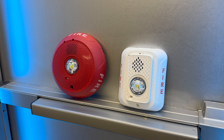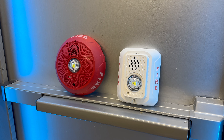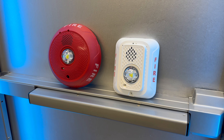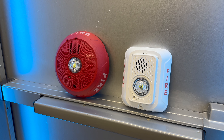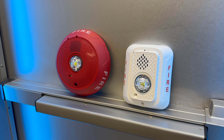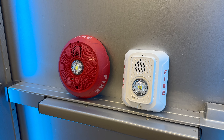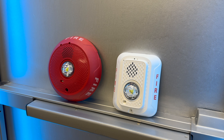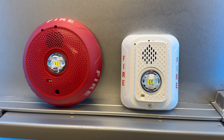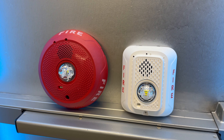So that's about all I can give you for our actual test of these devices. However, let me know if there's anything else you guys want me to show you. I do think there is definitely some things that either Nick does not know that are already in existence, or there are some big changes coming to sync options on panels that are going to support these new devices. New panels as far as these new settings - not only for the horn but the strobe - the horn having this Temporal 4 and 3 combined means it will be able to do fire and carbon monoxide evacuation tones from the same device, which is going to be huge. And I'm not sure if for the Temporal 4 it would still flash the strobe or not - that could be really interesting. And the strobe being selected from the fire alarm panel is what I would think the FCP setting is, much like what Simplex does with the ES series.